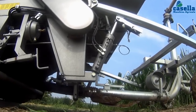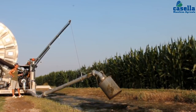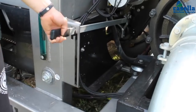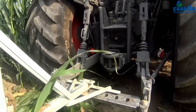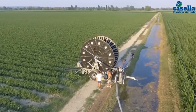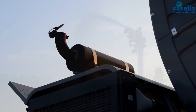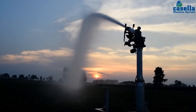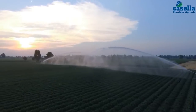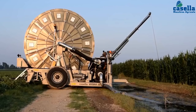The characteristics of the irrigation pipe vary and the thickness and length are selected individually. One advantage of the system is its simple installation, which can be done by a single operator in a couple of minutes. It operates at the expense of water sucked from the irrigation canals or underground pipes and is equipped with a special water lifting boom for this purpose. Water is absorbed by lowering the pressure. The system is economical, uses a small amount of energy, and the hydraulic systems are driven by the engine. It can be used to irrigate a wide variety of crops.